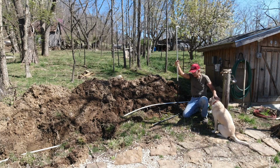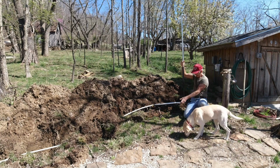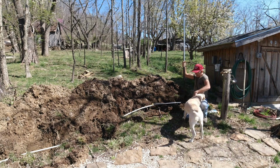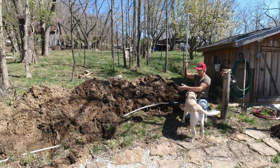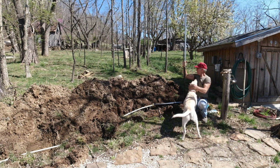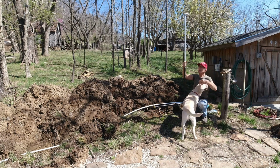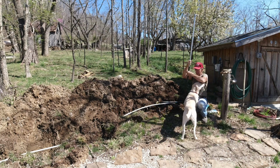There we go. So anyway, what I'm doing here is using 3/4 inch galvanized iron pipe, and I'm putting a T, and I have 3 feet of pipe here that is supporting this T, so that once that's backfilled, I can plumb up this pipe, or while it's being backfilled, I'll plumb up this pipe. And as muddy as this backfill material is going to be, it's going to be a little wiggly at first, but once it dries up, it'll be rock solid. And if I want to form some kind of hose bracket to hang my hoses on this, I can do that. So here we go.